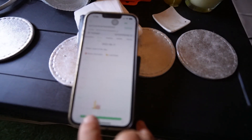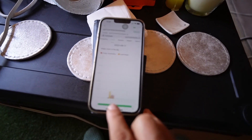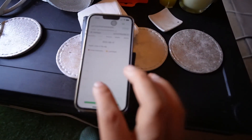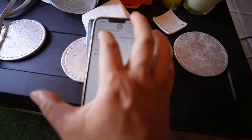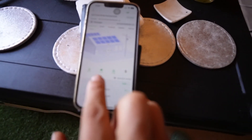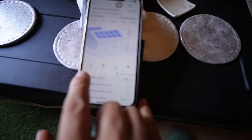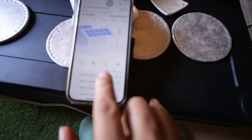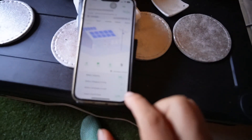A rice cooker — I was cooking breakfast — and now it's charging, shown in orange, and it's stopped charging now. It's basically just trickling energy through to the battery. It's at 100% so it can't go over. The solar at the moment is 1.25 kilowatts, it's using 40 watts at the moment, and there are the specs here as well.